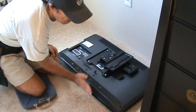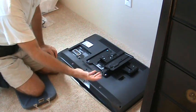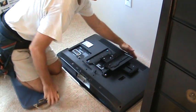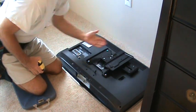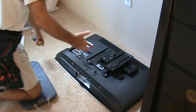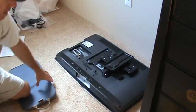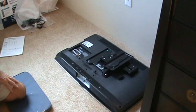That will allow this room here. I couldn't just bolt that at five foot two and say okay, that's fine, put the TV up there — you forgot about that. You measured from the top down thinking that was the bottom, so you measured five feet two from the wrong direction and now you're wrong. That's why you spend a little bit of time, get your bearings, and understand your project before bolting anything up to the wall and making holes. You want to do this right the first time.